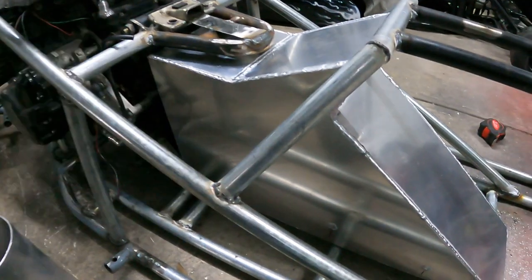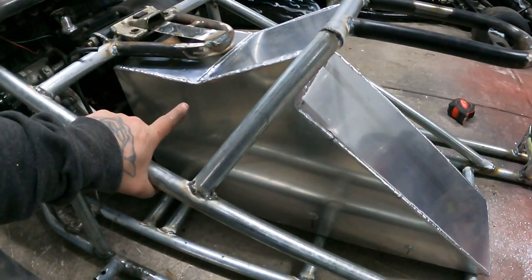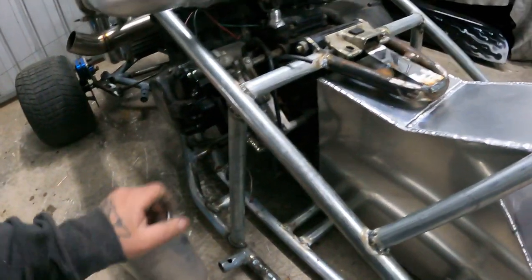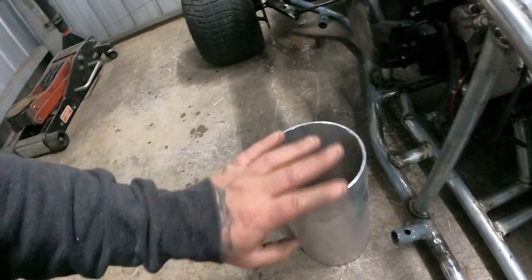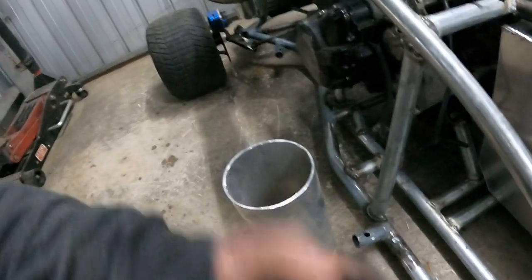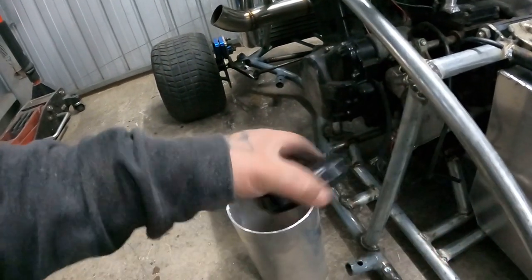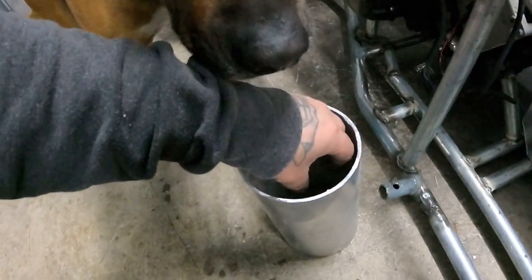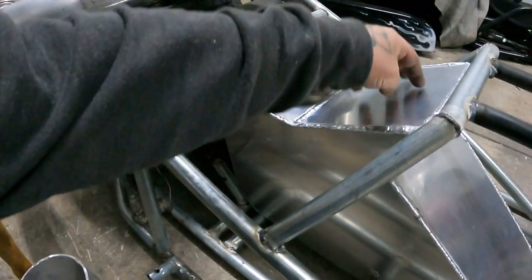The other option has a lot more fuel than we actually need on board — this is over a jerry can full anyway. So we'll go the recess route. We'll wait until the filler cap arrives, cut the hole ready to go, then cut that much off, plate half of it. The two-inch cap will be welded on the bottom and then TIG welded recessed on the outside.